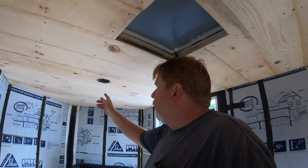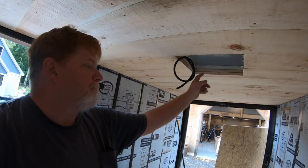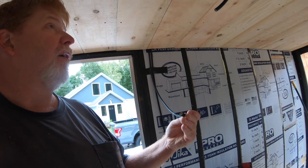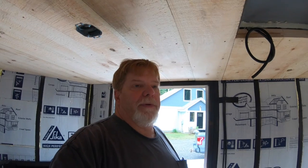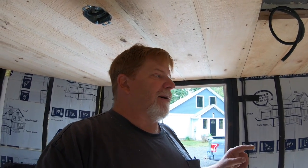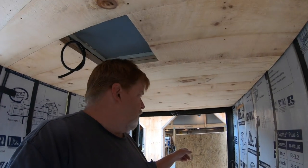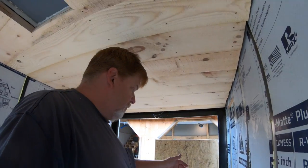Shiplap pine — like my whole house. Jen and I worked on this a couple days ago and got it all up. We love it. It's going to be cool. There's going to be a light right here, switched over here, and this is for the fan. I'm using stranded 12-2 wire because everything I've read says you should use stranded wire in a cargo trailer. I'm using 12-2 because I've got 20-amp circuits going in. Today's project is to get the wall board back on — just using the OSB that came with the trailer — get it painted, and then paint the floor and build the interior wall.